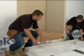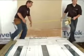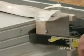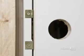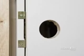Now we are ready to begin. For step one, check the width and height by measuring the size of the frame — width and height — not the brick mold. Next, remove the cleats and packaging, but keep the door fastened closed with the transport clip. Do not remove the transport clip or open the door until instructed to do so later in step seven.